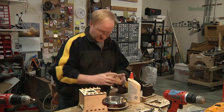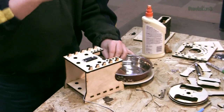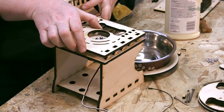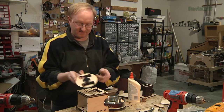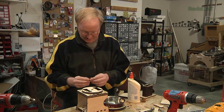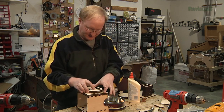Got more parts cut for the dispenser. There's going to be a little scoop here that channels the bone into the bowl, and the bowl is actually in this ring so it's always positioned relative to the device — because if the animal knocks the bowl away, the treat wouldn't go in. We have a servo here mounted into the first plate, with tabs that space out the plates. Then there's a second plate, and this is what actually rotates and connects to the servo. This is a continuous rotation servo, which means we need to know its position, so we're going to use this opto-interruptor. The tabs rotate around, and that's how the operating system will know how it's positioned. I'm going to start assembling this.